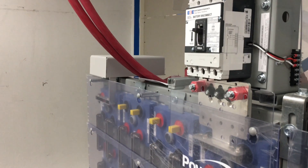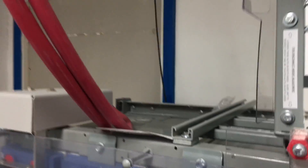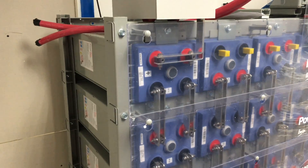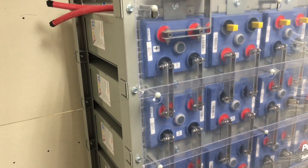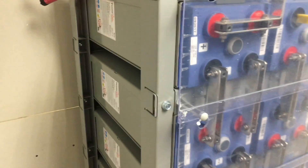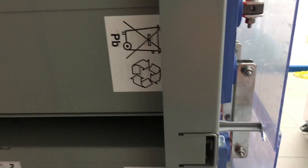The installation is still in full swing and they're just taking their time, not in any great hurry. It's a full bank of batteries here — 48 volts each, at a thousand ampere hour per bank. There are 24 cells connected in series, 2 volts at a thousand ampere hour. Each bank has a total of 48 kilowatt hours. Put the four banks together: a whopping 192 kilowatt hours.